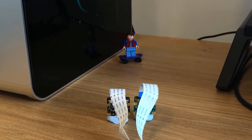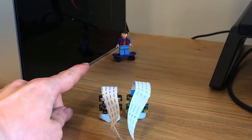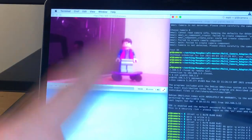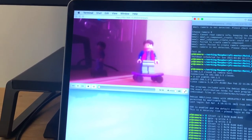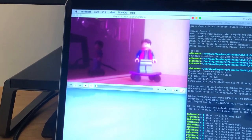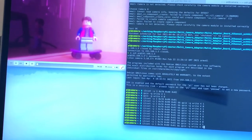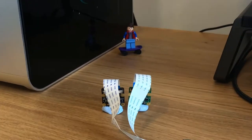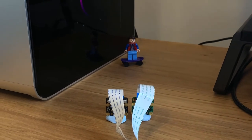Okay, first test of the camera setup. On the left hand side here I've got my NoIR camera pointed at Marty McFly over here, and I've got that streaming over Wi-Fi. And look at that — he's right there. Got a bit of a pinkish hue, that's just because of the fact there's no infrared filter on this camera. But I'm just going to toggle over to the other one with just a single command, like so, and the stream is automatically updated to point at the camera on the right hand side. I think this is going to be viable.